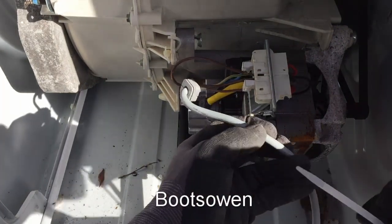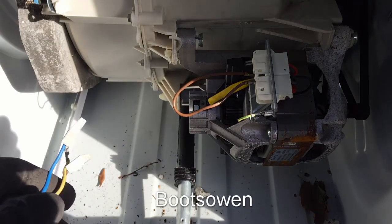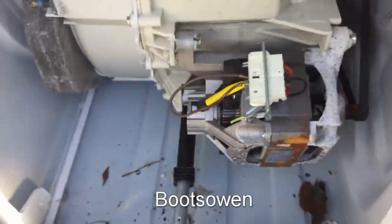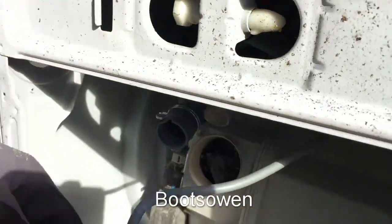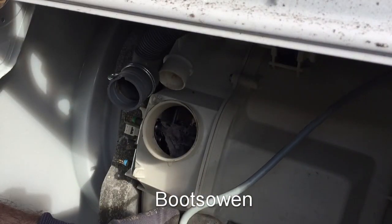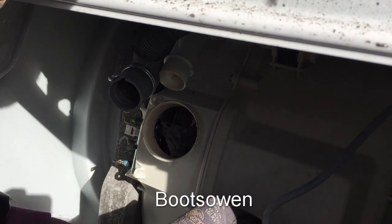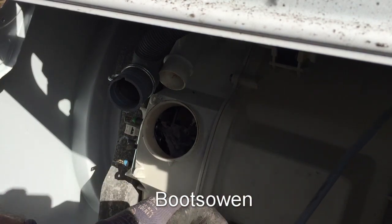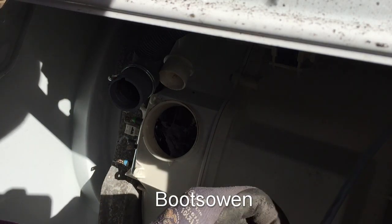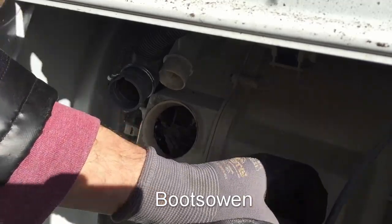It's very windy, so that's how you wire that for maximum speed. But what I would like to do is get this in somewhere through the back — there's a hole in the back of the machine just up here. I'm going to feed the cable in through that so that it doesn't pull underneath it and get crushed, and then pull it back down again, wire it back in. It doesn't really matter which way around these go, so I'll just push them on whichever way they go first. And what I want to do then is secure it with a cable tie to make sure that it doesn't get pulled away if the machine starts running away, so I'll just cinch this down — and this one is ready.